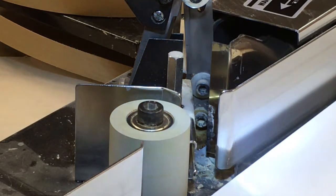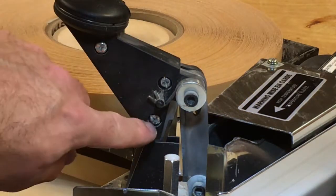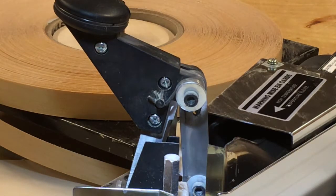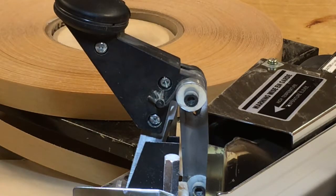The second thing I did with the cutter is I took it apart, loosened these screws, pulled the blade straight out, and honed it on my sharpening stones like I do my chisels — got it quite a bit sharper. That helps a little bit, but it is hard; you have to hit it pretty hard to cut PVC edge banding. With wood tape or melamine tape it cuts no problem, but PVC you've got to really hit it. Those are two modifications I recommend in the cutter area.